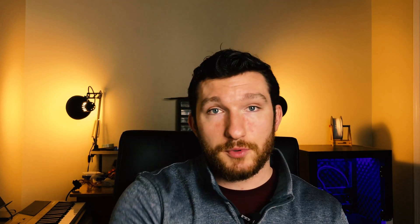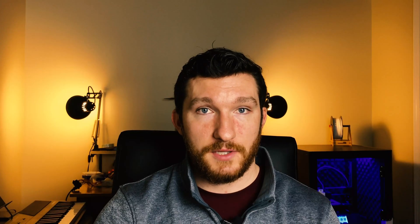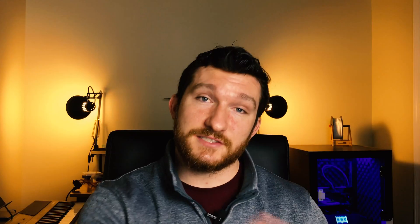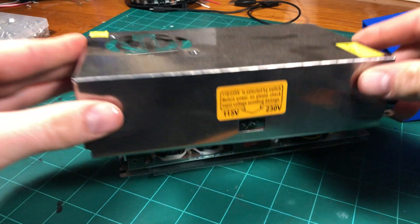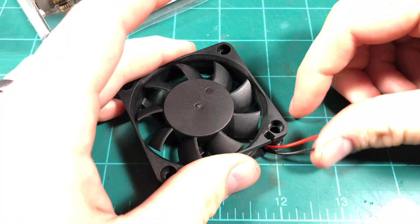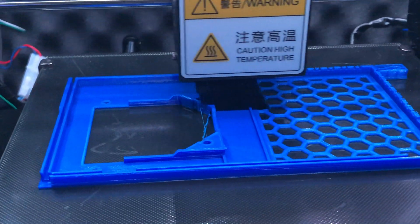To do this, I unscrewed the four bolts on top of the printer body that are holding the power supply in place, as well as the two screws that are holding the power input port in place. Once I had the power supply out of the enclosure, I added some female Tamiya plugs to the power cables going to the MOSFETs as well as the motherboard. Then I started working on the power supply itself. The power supply has one of the loudest fans on this printer, so replacing it will cut down on the noise drastically. The first step is to remove the cover on the power supply and cut the cables to the fan. I replaced the fan with a 60x25mm Noctua Premium Silent Fan, which is a little bit thicker than the stock fan, so I had to print out a cover to mount the new fan to.